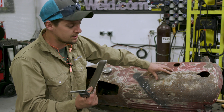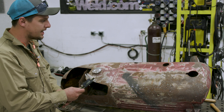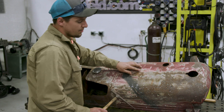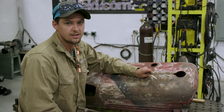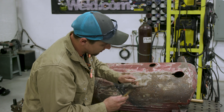Second, we found the material. We're gonna go lay this out and identify where we have good solid metal. I usually take my little peening hammer — my body hammer. My dad gave me this a long time ago. So we see rust. We wanna first figure out — we don't wanna get in a rush and say we want to do this whole area. Take our time and not jump the gun and cut a big whole area out.